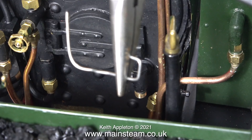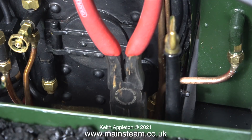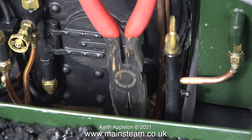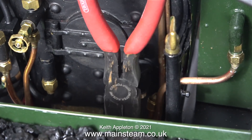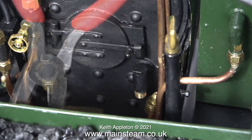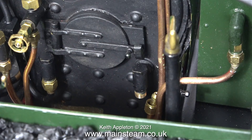But for the moment it is free, so I will try the engine in steam and see what happens when I open the injector valve. Here's a shot of me using the pair of pliers with the bent piece of wire, and as you can see it took a while to unstick the ball from the seat. Ball sticking inside check valves is fairly common — what you normally do is tap the top of the check valve with a spanner, but I can't really get to it here.